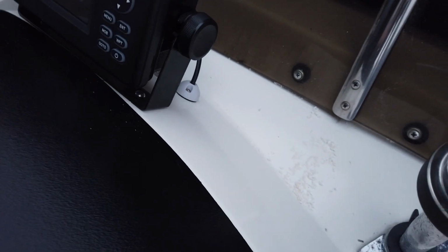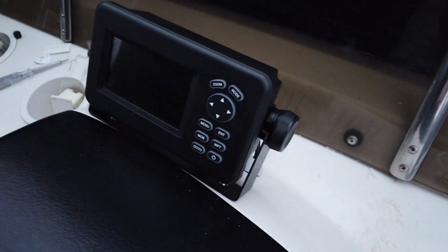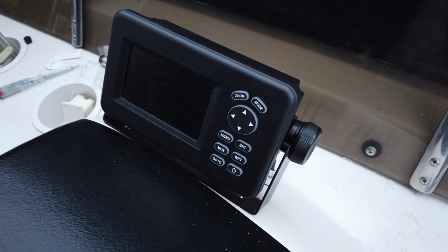Well, that was not easy. I've got to solder those wires on, and that was a pain in the backside. It took 2 of us to hold the thing. They were very, very fine. Well, that's now coupled through, so that's the ActiSense part connected to the back of the Matsutec. And now what we've got to do is put the backbone cable in and the T-piece, and then connect that all into the network. So that's more crawling underneath, I'm afraid.